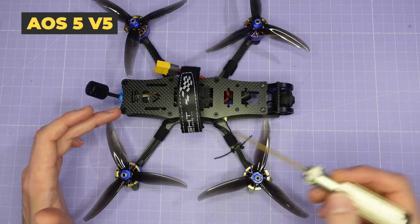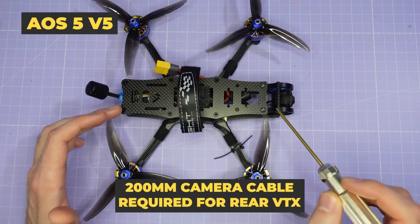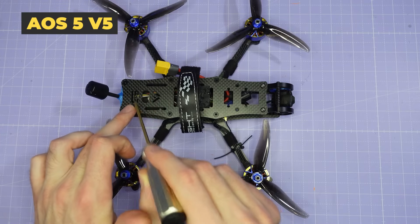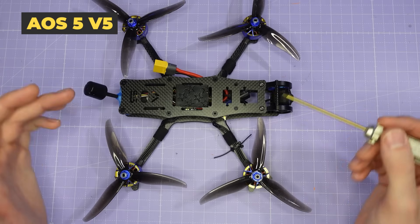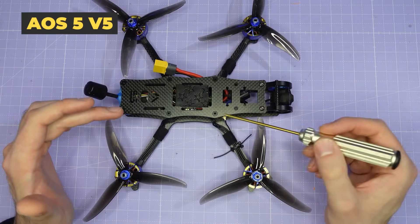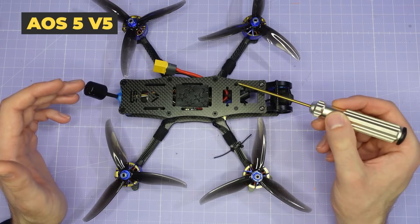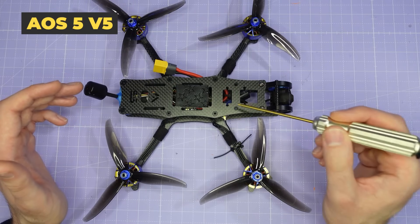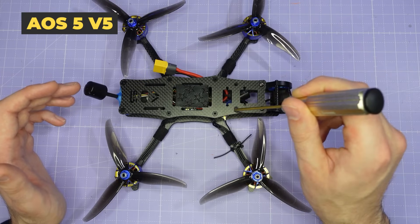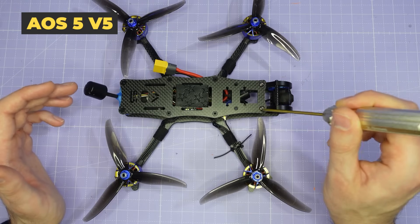So that's the reason I went for a long body — it's purely for flight performance. One thing to note if you're building this frame out with a digital FPV camera: you are going to need a 200mm camera cable to stretch from the rear VTX mounting to the camera because of that slightly longer body. Now let's run through the features on the top plate, starting up front with the GoPro mounting.